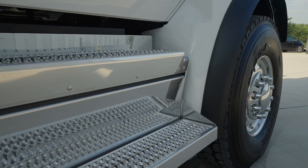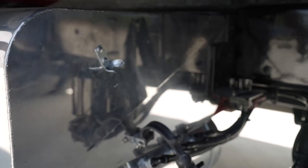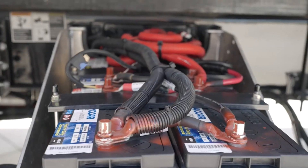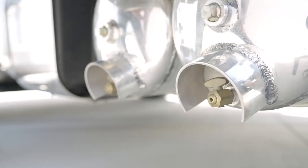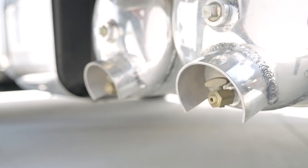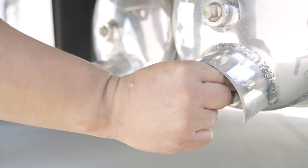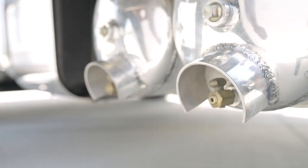Check all steps and grab handles for debris and stability. To check the battery, remove the battery cover for access and check for any corrosion or damage to the batteries and alternator cables. Check the air system tanks for moisture. To eject moisture from the air system tanks, either twist the valve or pull the line connected to the moisture ejection valve until the air comes out free of water.